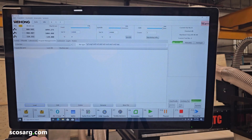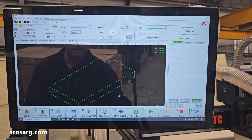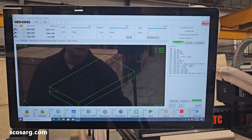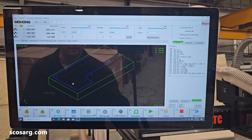In program management, you can see all of your program files. In the log, this will show any error messages that display on the screen — if you have any error message, you can look on this and it will tell you what the problem is so you can hopefully sort it out. Now we're going to load a program on the machine ready to run. We choose the program we want to run, which displays up here. You can even load the track so you can see what the machine is going to run. You can see here we're doing a desk — it's a pretty simple program for this machine, just to show you what it can do. It can handle far much more than this.